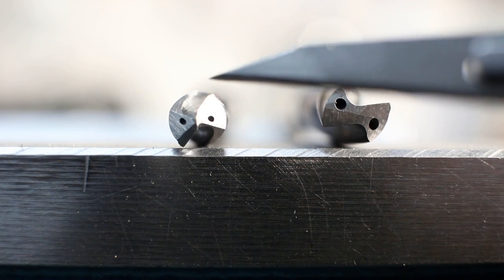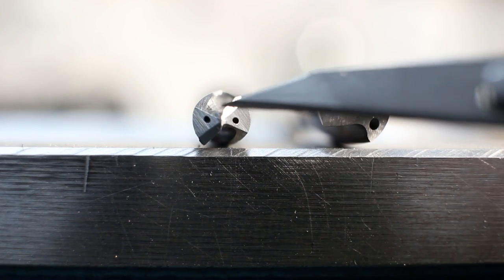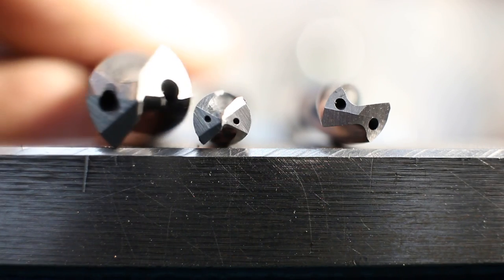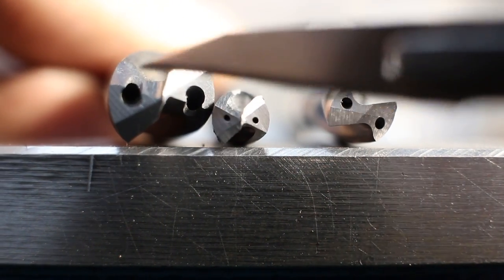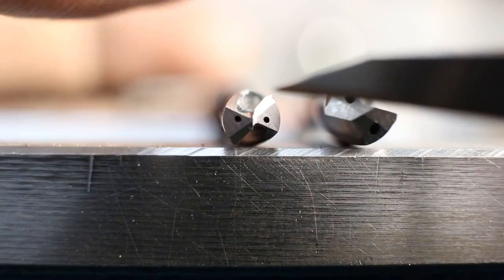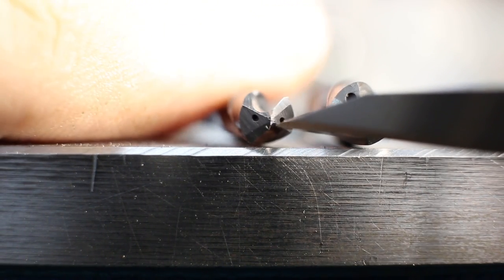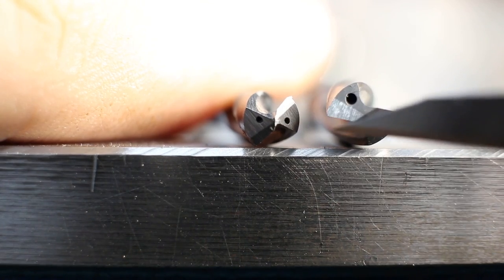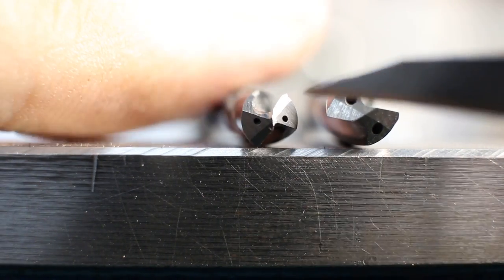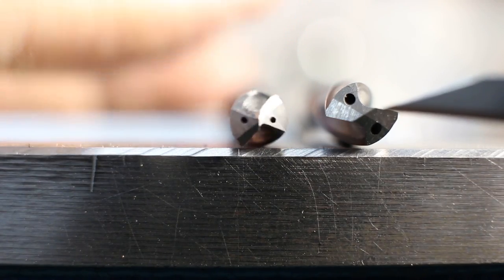So I played a little bit around, and I replicated the original thin web of such a carbide drill, like this one here on the left, which has this large gash cut into it. And I replicated it on this one here. And this thins the web by a lot. And by running this on a mill, drilling, it's a difference between those two styles of night and day.